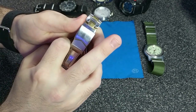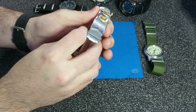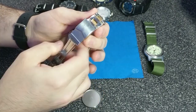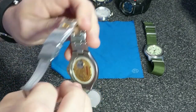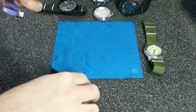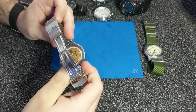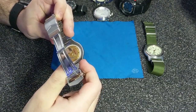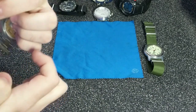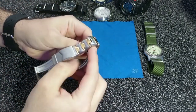See, when I'm about to change the battery on a watch, I leave the case back a bit loose if I want to come back to it. So you can see it's a quartz movement, but it's a nice quartz movement. It actually has, let me check that. 3 jewels? Yeah, 3 jewels, which is not that common in quartz movements.